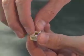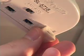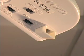Remove the protective backing from the bottom of the light shield. Then position the light shield over the photocell with the opening facing away from the interfering light. Press the adhesive side firmly against the photocell to mount it permanently in place. If the light shield is correctly positioned, the light fixture should now operate properly during nighttime hours.